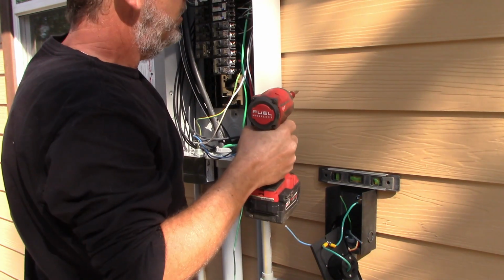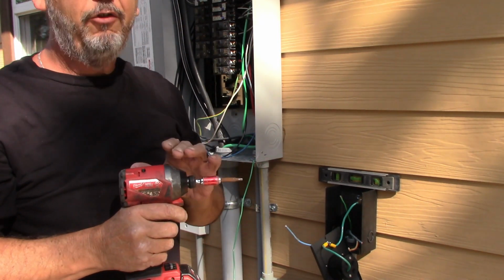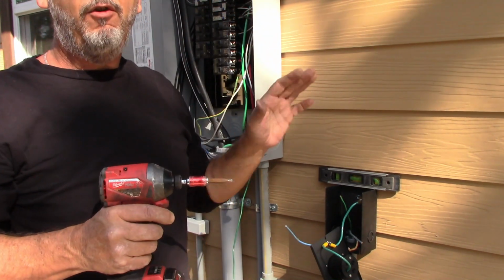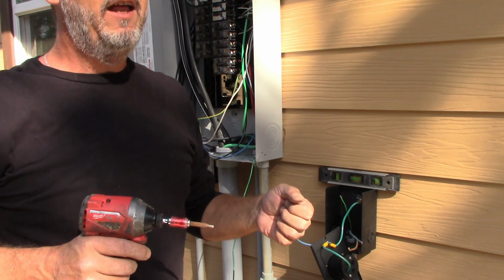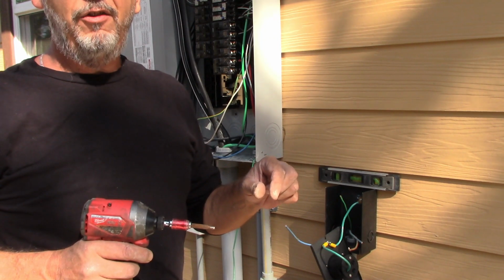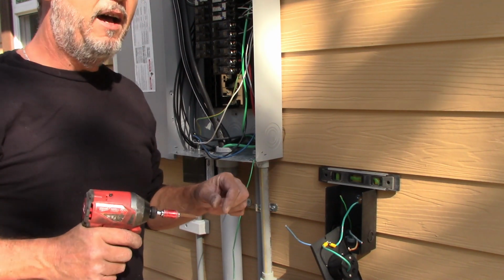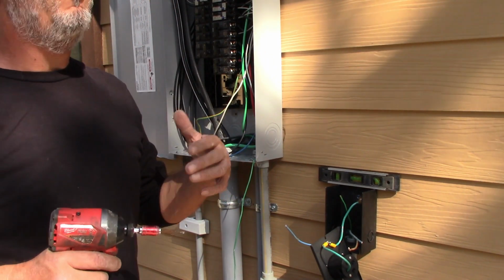Now, if you guys notice, you may or may not have, I'm counting clicks on this. Wires where they attach, whether it's an outlet, receptacle, switch, or breaker, there is a torque specification. You can't just take a screwdriver and tighten it as tight as you want, or too loose. Too tight, you'll crush the wire, you'll flatten it, you'll change resistance in there. Too loose, you create what's called microscopic arcing. Microscopic arcing will ignite the oxygen around it. It builds up carbon, and eventually it will ignite.